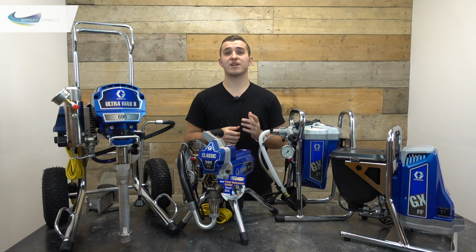In this scenario, the mist coating is our most demanding job, so we need to spec our pump based on this. Because it's site work, we know our power supply's got to be 110 volt, so we know we're looking at the Graco 190 and upwards.